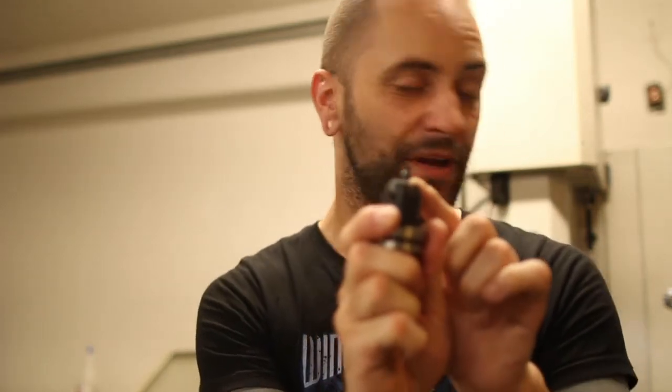It was pretty nerve-wracking learning how to cut a back chamfer because it's like your machine, so you can't even see. And you're having to blast lots of coolant down in there in order to keep the tool from getting clogged up with chips and breaking or overheating. This tool is very expensive. This is actually a $75 tool, and they last quite a while.